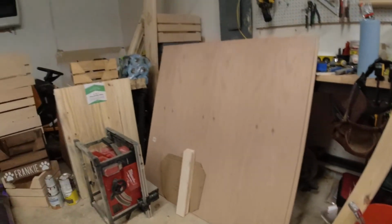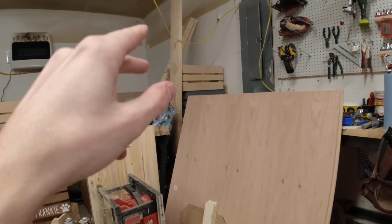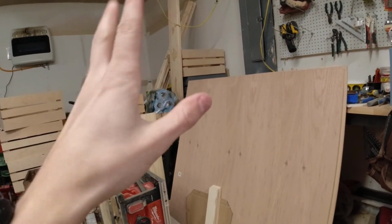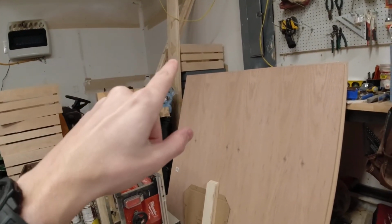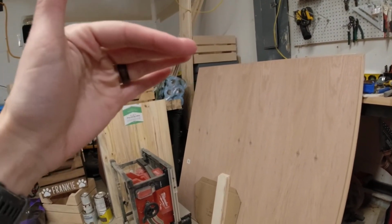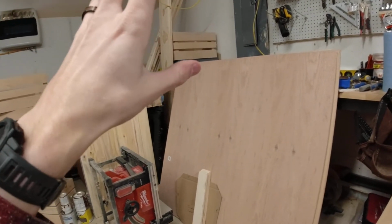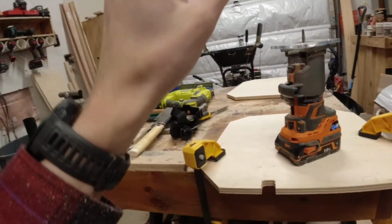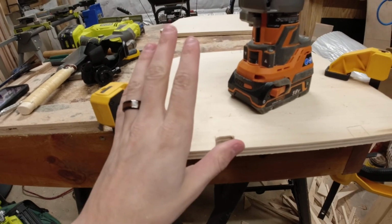That's gonna be the 1x8 and those 2x4s. I got to make 2 blanket ladder shelves. They're going to be roughly 6 feet tall once they're leaned up against the wall, and they're each going to have 4 shelves on it. So each one of those 1x8 boards will get cut down into roughly 2-foot sections, and those are going to make the shelves. And those are going to be for holding pictures, and those are also going to my wife's aunt's place, which is where these chair bottoms are going.